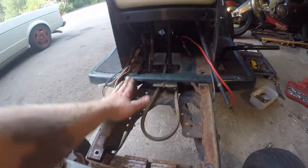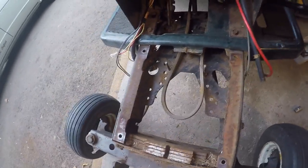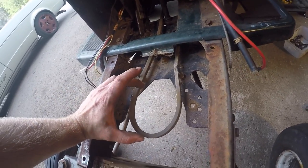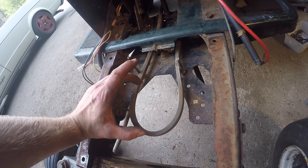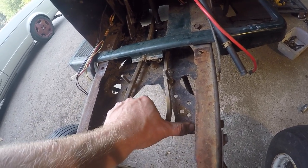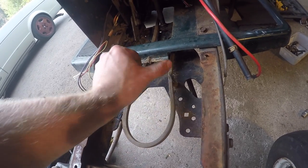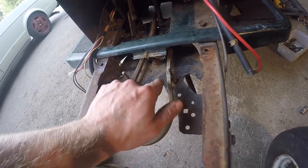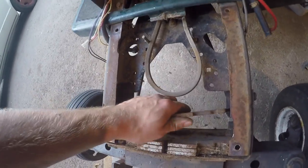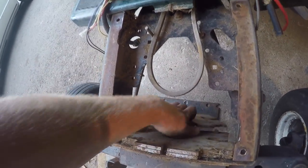Here's where the engine came off — we've also taken the engine mount plate off so we can get down in here. The engine usually has a small three or four inch pulley, but to get the gear ratio right for a bit more speed, we're going to widen that — probably something like a six or seven inch pulley. These little tangs are going to be moved out, and this also gives us the opportunity to remove all these weight blocks.